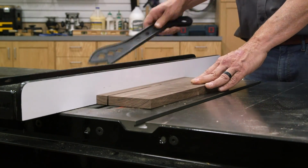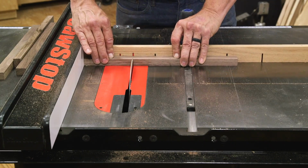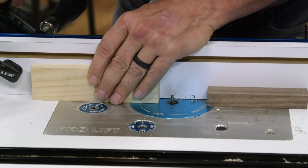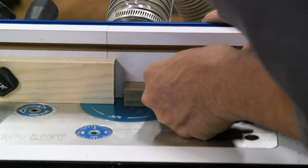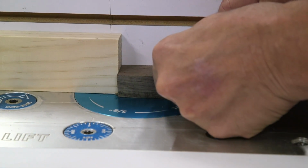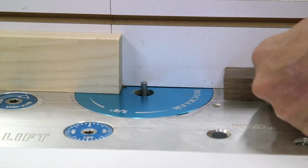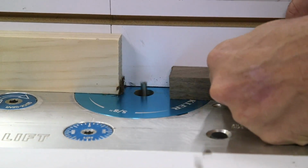Now I'm going to cut 12 pieces to size. I'm using walnut, and I will actually make 14 of them in case I mess something up. Back at the router table, I need to plow a 1/4 inch wide, 3/8 inch deep groove into one end of each of the ray blanks. I use one of the extra ray blanks to set the cut up and locate the stop block to register the length of the cut, about 5/8 of an inch.